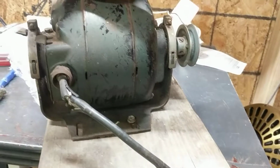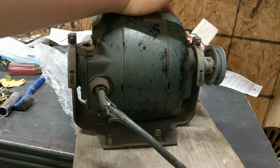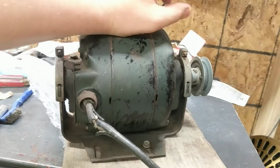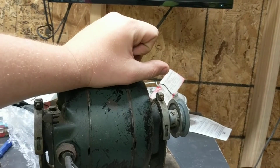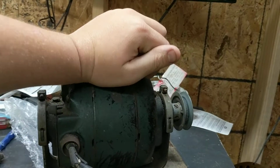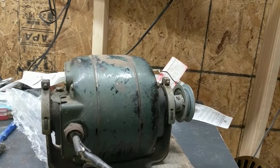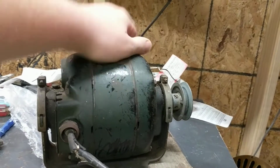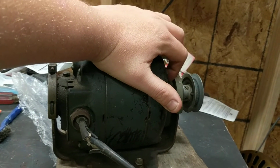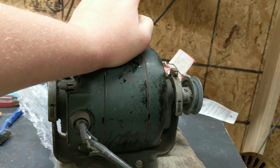So the main reason I decided to purchase this is my 24-inch Chrome GE Vortex has a bad shaft. I heated up a bronze bearing so that it would expand a little bit. It was a metric bearing, 12 millimeter, because the shaft had significant wear. I froze the rotor with CO2, dry ice, heated up the bronze bearing, and was able to slide it over the shaft and get it into depression. Then, due to the thickness of it, I had to reduce the diameter of that housing. Anyway, that's not a permanent fix, and it may outlast me, it may not, depends on how much I run the fan.